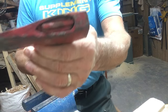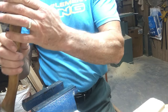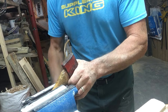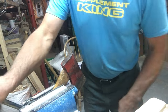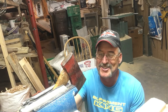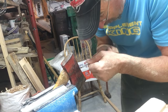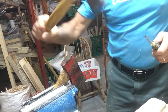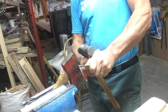Let's take the wedge out of this little red one. You can see there's a metal wedge in there and the handle has dropped a little bit since it was first hung. I'll put my rubber jaws in just to hold it. One important safety tip when taking handles out: point your blade down. If it's up you're going to get cut. I'm putting it down, then taking a screwdriver and working at that wedge — shouldn't take a whole lot.